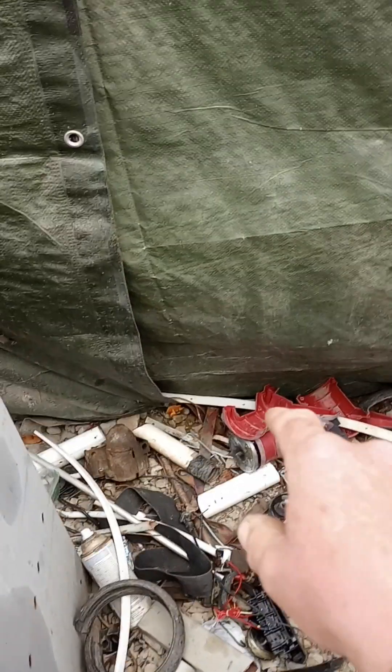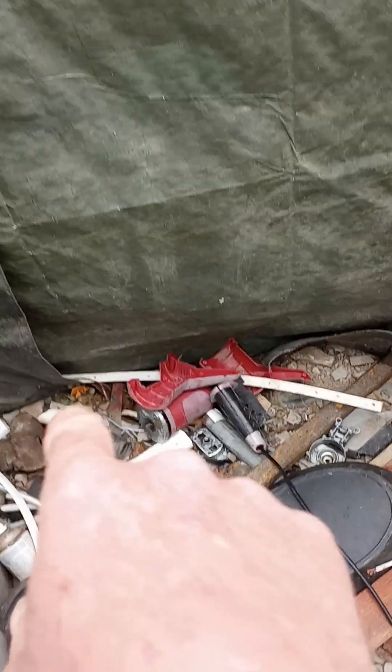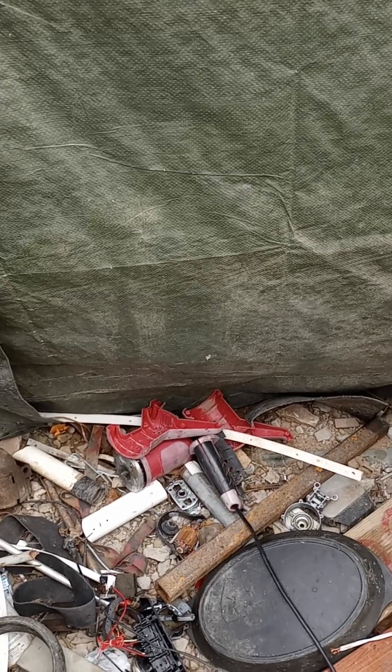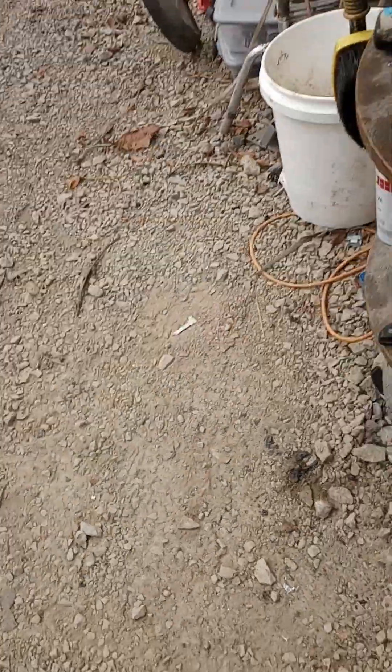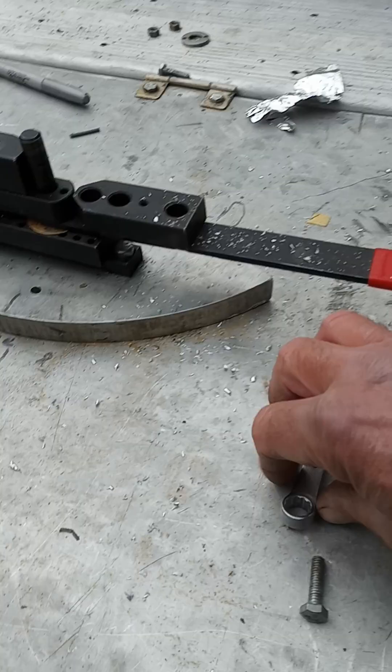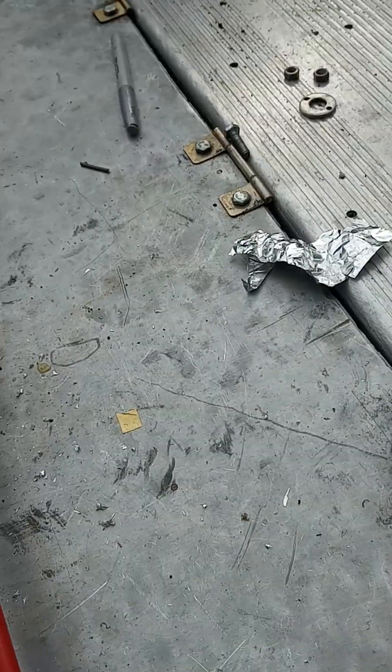So I think I'll re-approach this. If I can fix the issue of it burning the brush contact and dirtying the brass contact surface of the armature by using some silver wire, I have some remnants of high-quality silver wire that I can wrap around that contact and maybe stop it from fouling the contact surface.